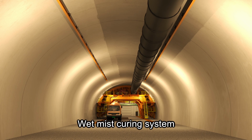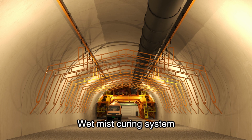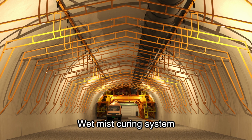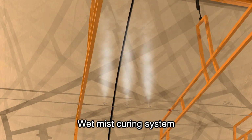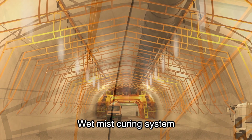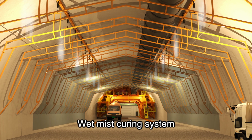During the curing process after lining, sufficient wet curing is performed by spraying mist at high pressure within an airtight sealed space covered with a sheet. The sheet extends over 31.5 meters and allows wet curing to continue for a week. Humidity in the space is maintained at around 90% and has been shown to be effective.